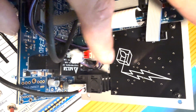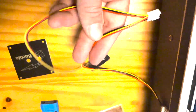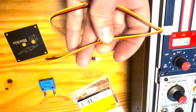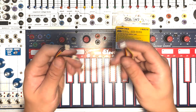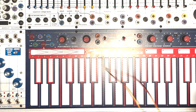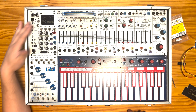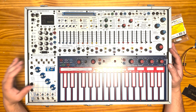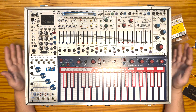Your mod will actually be longer than mine because when I made this, I just made it out of wire I had in stock and made it a little too short for comfort. But with this adapter you'll have plenty of extra wire to work with. So for about $5 to $7 per tiny jack and this $4 Molex splitter for fans that you can get on Amazon, you have a mod for the Music Easel MBO that adds a stereo effect insert or return, and you can do modulated panning using a module like the 292. If this mod helps you or if you have questions, let me know in the comments, and we'll see you in the next video.